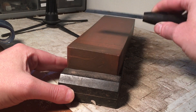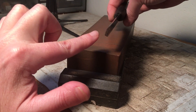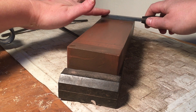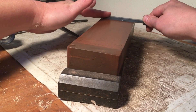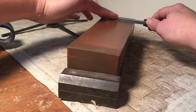I'm going to start with it on the flat side — you always start sharpening the flat side first. With beveled knives, there's a side that's slightly angled and then a side that's completely flat. I'm going to start with it in my right hand and do even strokes coming towards us. I'm using my right hand to hold the handle and my left hand to keep the blade flat on the stone.